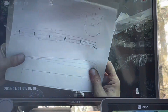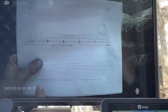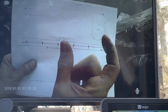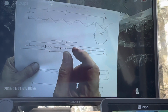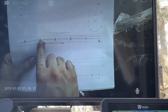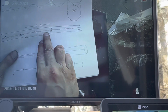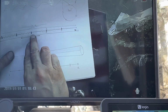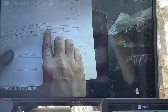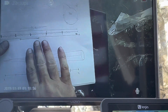And so what I'm doing in here is I have different points, nodal points, that I'm taking. You can see the vibration starts, and then you hit that first nodal point, and the magnitude of the vibration goes back down, and then it starts building back up, and then it hits another baffle point, and then it has to drop down, and it keeps doing that throughout each one of those baffle points. And as it goes, the overall magnitude of the wave diminishes because each time it's losing a little bit of energy, even though it's trying to push out there. And so that weight is harder to get started to move the further it gets out on that tangent, if that makes physics sense, if you get the idea of it.